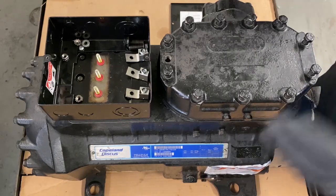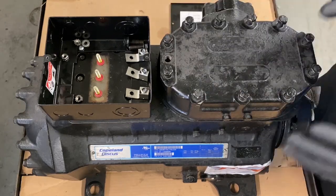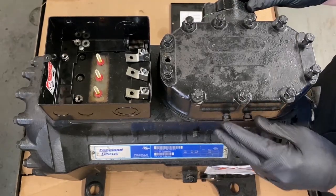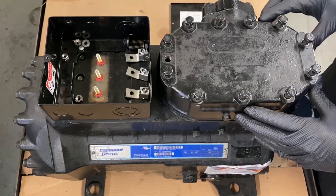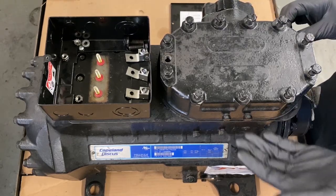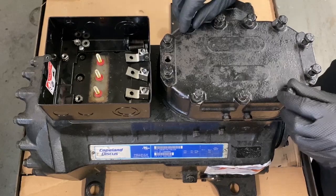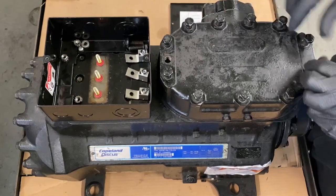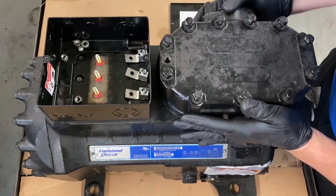Let's take the head off. A lot of mechanics are not doing this. Loosen the bolts up first. You don't want to just pull off the bolts, knock it, and take the compressor head off, because this is discharge gas — all this is discharge gas here. There could be pressure under here, so pull off a plug to make sure there's no pressure in there. You don't want oil or gas blown in your face. Another way is leaving two bolts down below then knocking it, so it doesn't blow the head off if there's a lot of pressure.